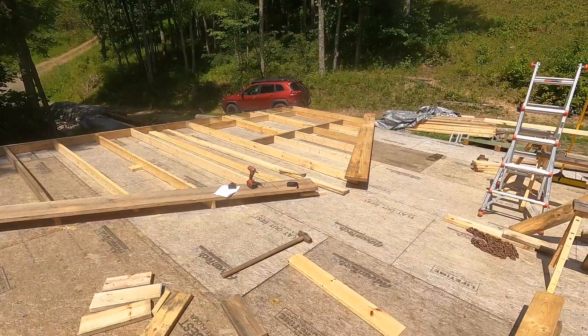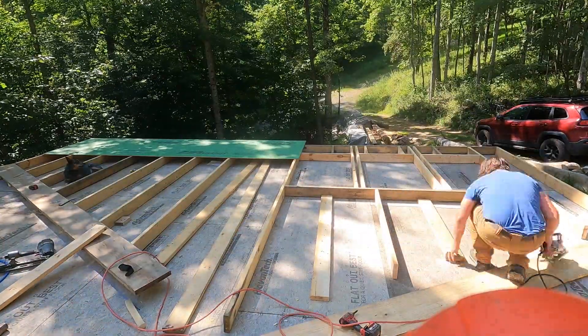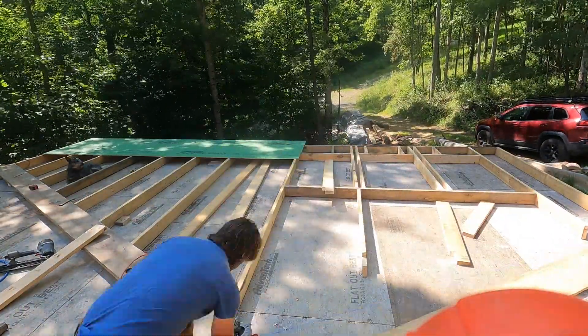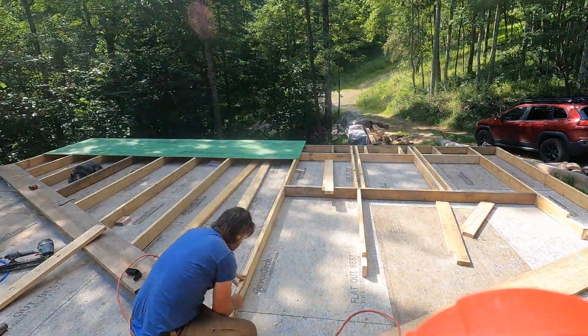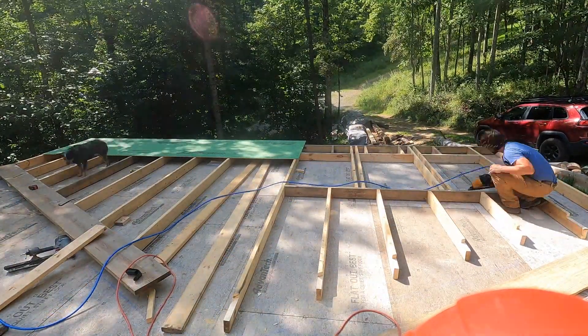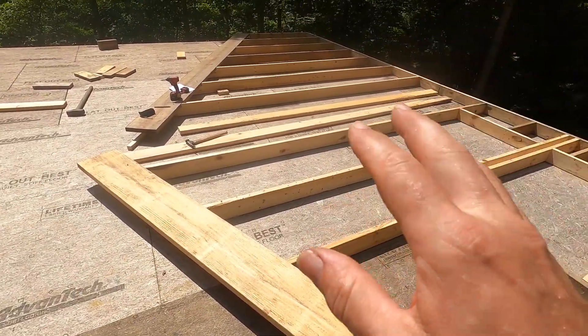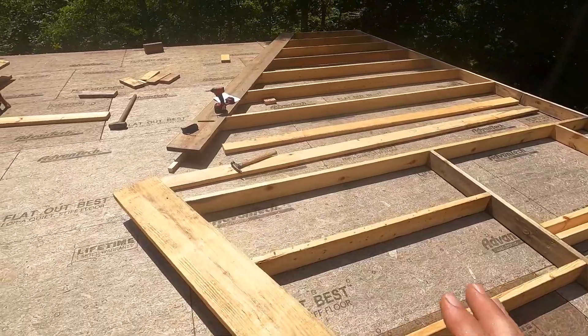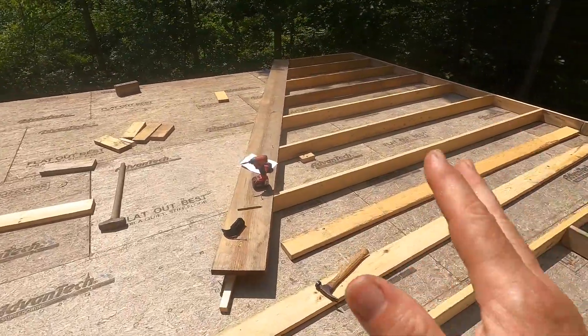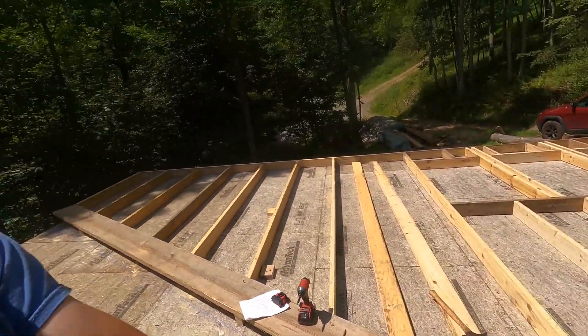I have it all squared and laid out. I have to cut my rafter here — I'm going to pull this off, cut that off, nail that up, and double check it for square one last time after about 30 times. I did have to make a few adjustments, but I got it square. And if it's not square, I don't know what I'm going to do. Anyway, that's it — stick around and thanks for watching.